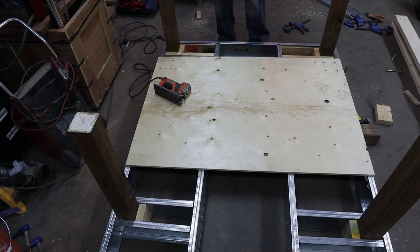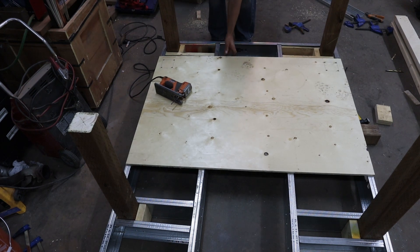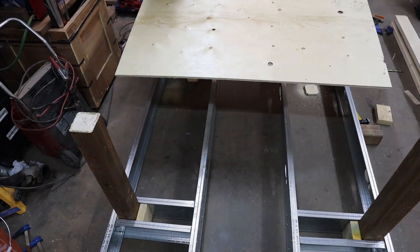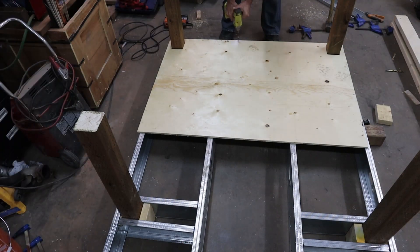It cut pretty late last night but I got all six posts mounted. I just laid my first sheet down, marked off where the post needs to be cut out, drilled some holes in the corner, and now I just have to cut them out with the jigsaw and set it in place. Then we can start squaring it up to the sheets.